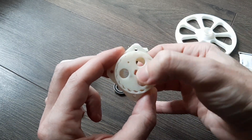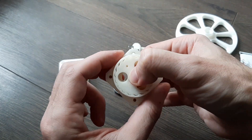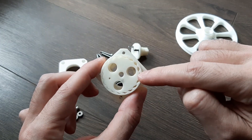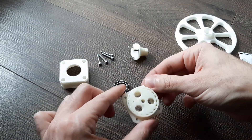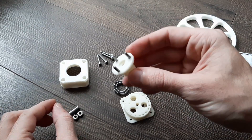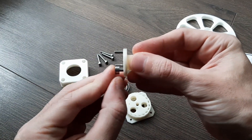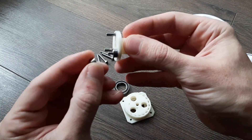This should fit really well — it's a really tight fit. So if your printer doesn't do well on concentric shafts where everything should be parallel, it should still spin really freely, but not too much. If it's wobbling around, that will increase the backlash of the drive.